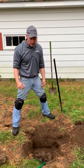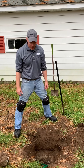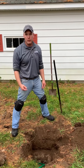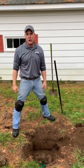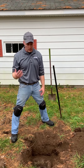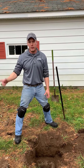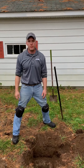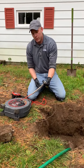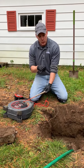If the absorption area can handle this, then it can handle normal daily use. If there are any problems in the absorption area that may take years to manifest, this can make them rear their head right now while we're looking at it. This is a concrete baffle poured with the tank; you have to watch because eventually they do erode and corrode, especially if there's a water treatment system putting salt into the tank, which makes the concrete degrade faster.